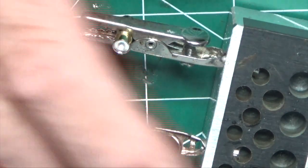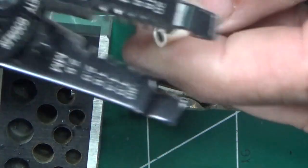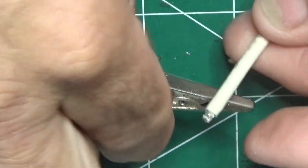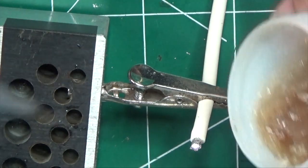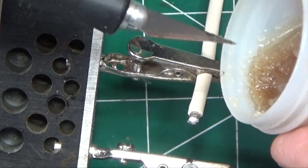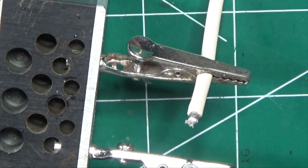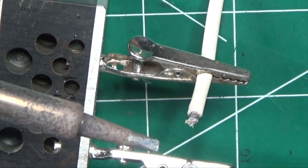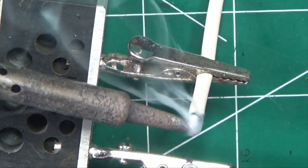Now we've got this connector ready. We want to get the negative wire ready to go into our connector, and we want to strip the wire — we already know what size we're using, the two millimeter wire. Get our solder flux, get our soldering iron ready, add some solder, then feed some solder in there and get your wire good and tinned.